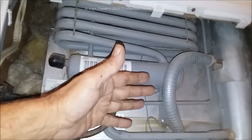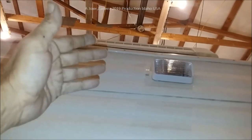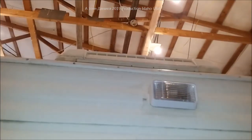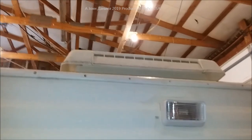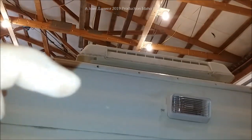There are screws on the top of those caps — make sure it's clean. Bird nests and other things: no debris, no straw from pine trees or pollen build-up on the screens and mesh up inside there. You'll see there are screws either under the lip or up on top of these vents. Make sure nothing obstructs that secondary opening above the refrigerator.